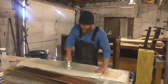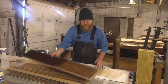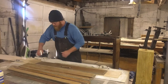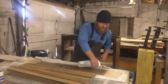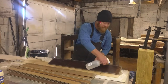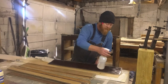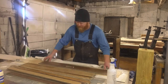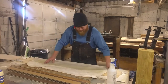This process I kind of learned from pulling dents out of wood. Right now I'm heating up the surface underneath to show you how this is reacting. This is probably around the 1920s era. I've kind of soaked the side down a little bit, basically just using straight water. Getting it wet — I've already sprayed it once, so it's soaked a little bit. You can see where I've sprayed it — it's just sucking that stuff right in. It's been sitting in some weather. Looks like it's been in a barn or basement for years, but no major rot — just neglected. There's a lot of quarter-sawn oak on this. It's all solid panels, no ply, so we're going to try to straighten this out. Our only other option is to replace them, so we figured we'd give it a shot.